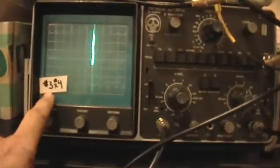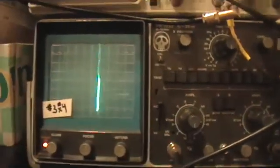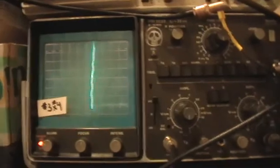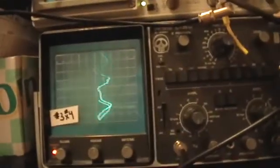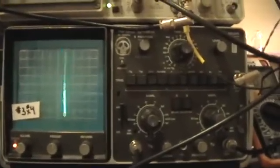This oscilloscope here is watching sensors 3 and a signal from 4, and what this is doing is displaying a vibration trace that allows diagnostics of pretty intimate character. It's quite sensitive to vibration. You can see a little bit of vibration right now — that's actually because the drive motor is running. If I give the base of the unit a little bit of that, you can see that the vibration sensor is very sensitive. With this I can pick up rumbles, bearing rumbles, acoustic resonances on the disc.